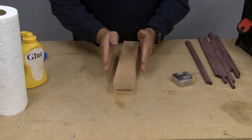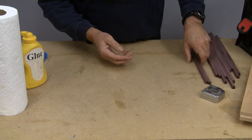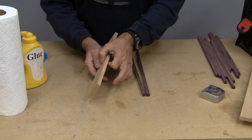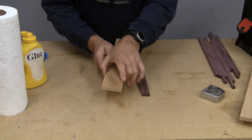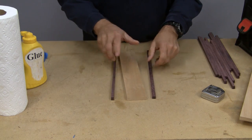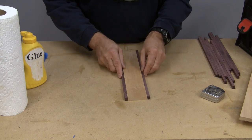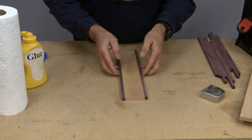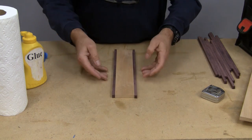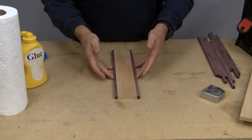To keep this project moving along, I've cut my pieces here — the inner pieces — and I've also cut the side pieces. They're three-eighths of an inch thick and two-and-a-quarter inches wide by 13 inches long. It's not imperative that those dimensions, because you can work with whatever you've got. What I'm going to do now is just quickly go ahead and glue the ends or the sides on here just to give a little bit of different contrast.